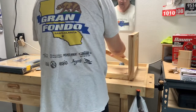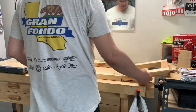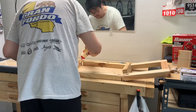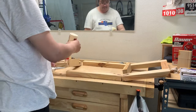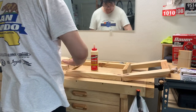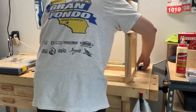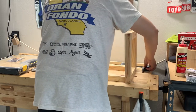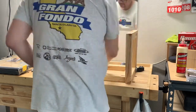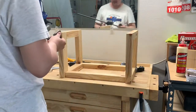I dry fitted all the pieces I had, cutting them down as needed to make sure they fit the bins and the space. My design was a U-shaped box, and I would cut dados along the side frame to insert slats from a pallet to serve as runners for the storage bins. Unlike my original design with adjustable shelves, these runners would be fixed with glue, so you can only use single height storage bins — but that's all I really needed.